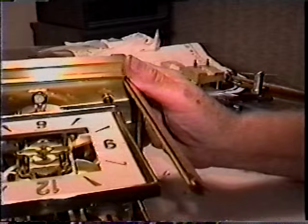Now a good practice to do here is don't turn the screw at the top, because that spring is hanging unprotected. Just hold the screw tight and just turn the pipe, and screw the pipe up into the screw so you don't hurt that spring in any way. It's very delicate. Like I told you, it's only 2/1000ths of an inch thick. We'll do it nice and careful here. It takes a little time to do this, so don't be in a hurry, because you're going to break it. It is very, very fragile. Okay, have it down tight. Now with my screwdriver, I'll lock it tight.